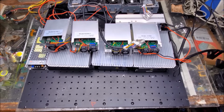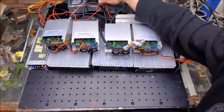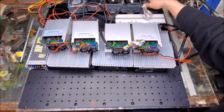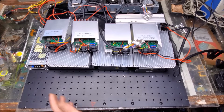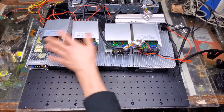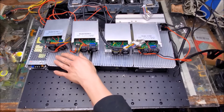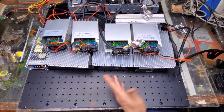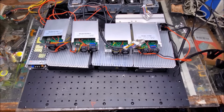So this is the first thing to really take care of, making the holes for the fans. So 7mm wide holes and marking out where the screws need to go and tapping that. And then I'll go marking out the laser heads, other power supplies and stuff like that. Mark out these, and the laser heads, tap those, move on to the heat sink, and so on and so forth until this is a complete laser. But there's a lot of work ahead of me to build this.